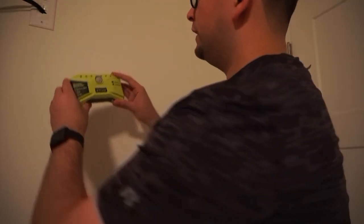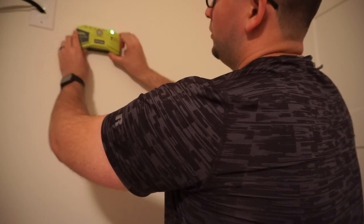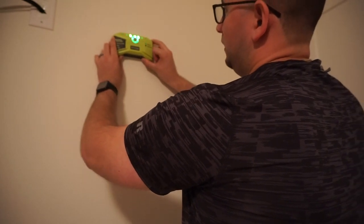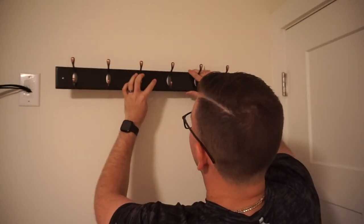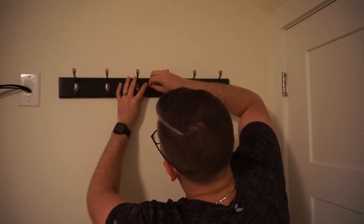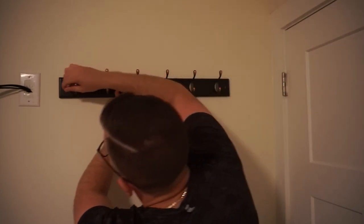Using my stud finder, we're going to try and see if we find a stud. Let's slowly move it around — and it looks like we found a piece of one. Keep going and there it is. I'm going to mark it with a pencil to make sure I know where the middle is. I found another stud that was more towards the center, and I'm going to use that marking as my center hole. Let me line that up — there it is. I'll draw a little circle with a pencil and mark where the other two holes go.